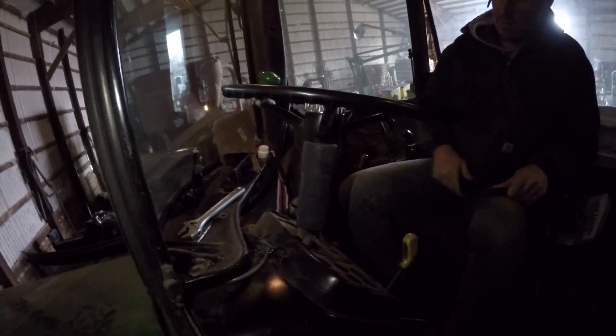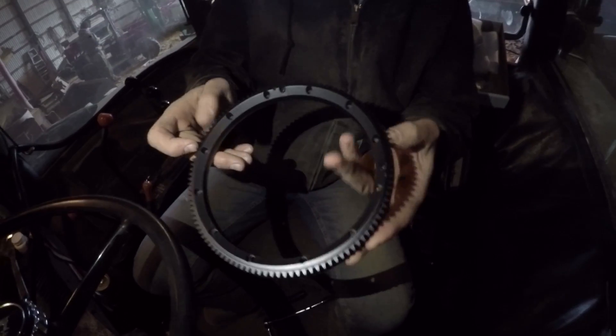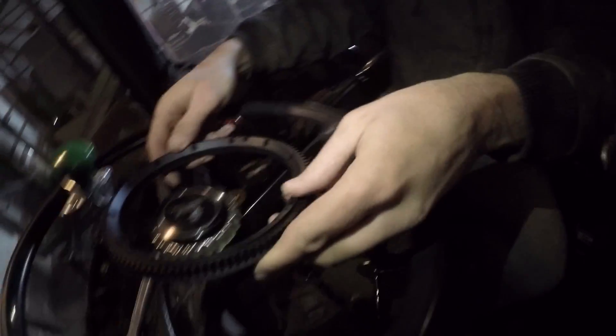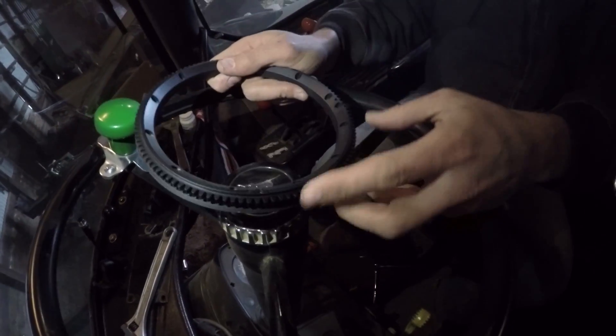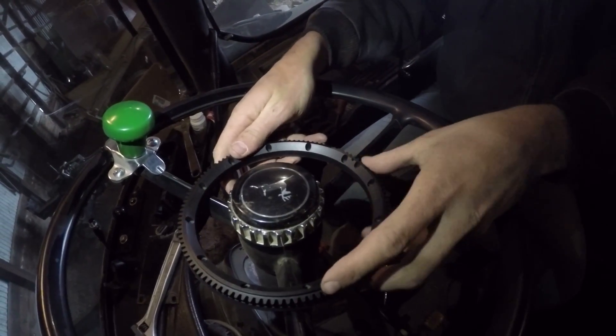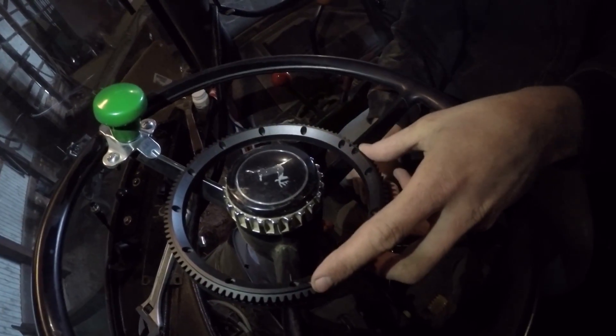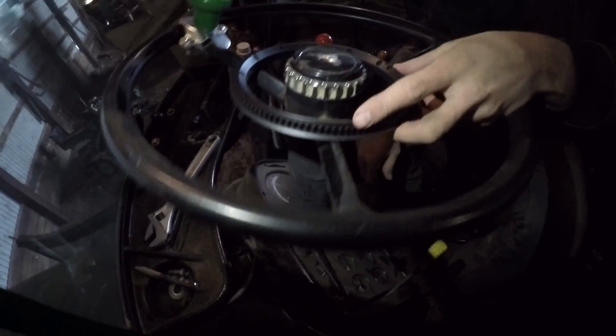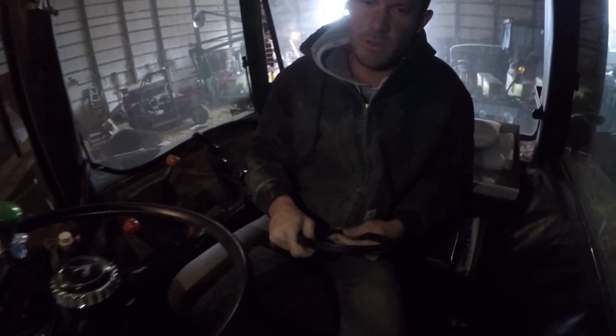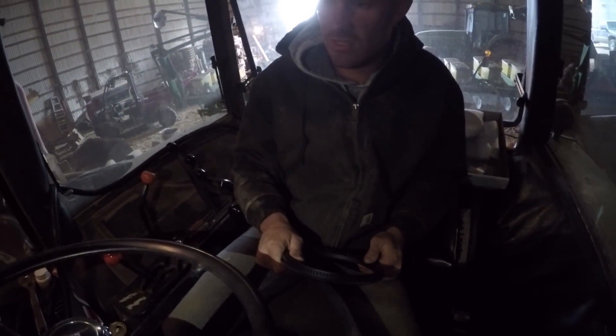Here is the steering wheel pre-installation of the Autotrack system — I wanted to get a quick shot before we install the system. This is the mechanical ring gear that actually turns the steering wheel. Once the steering system is installed, this will be sitting underneath the steering wheel. This comes apart here — there are a couple of sections that are going to sit in there, and the mechanical drive is going to turn the wheel right or left. We also mount an anti-rotation device below the steering wheel to hold it in place. So this is before installation — I'll go ahead and get started putting the ring gear in.